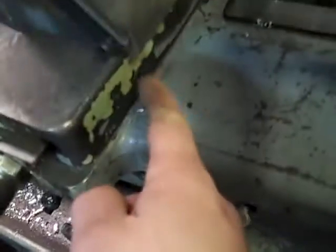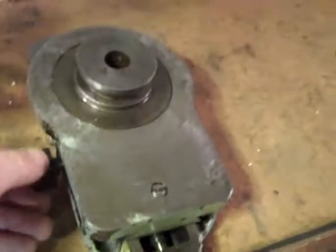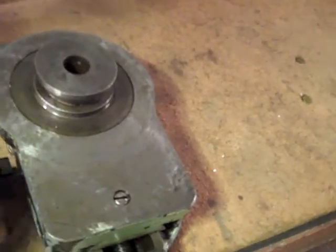With this setup I've put a lock screw on my gibs for the cross slide and a lock screw on the other slide. There's also the saddle lock to lock the Z axis from going anywhere if needed.